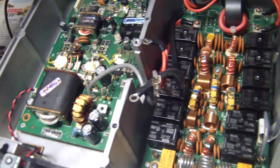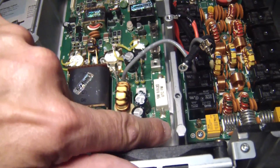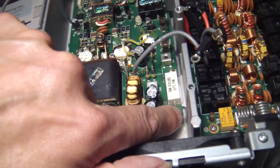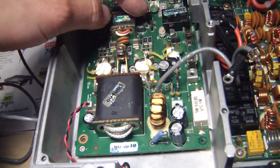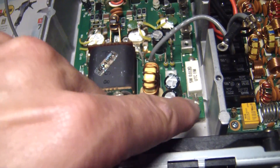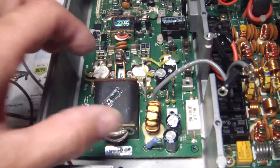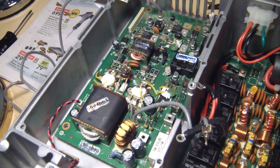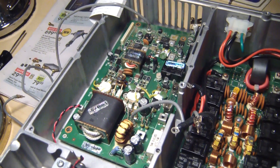Let's hook everything up. There are a couple of places I'll have to desolder — one there and another where I check the driver and the bias current. There'll be two settings I'll have to check. I have to desolder these connections and hook up an ammeter, but at this moment I'm just identifying if this solves my problem. If it's a go then I will do that. So let me hook up these cables and continue.